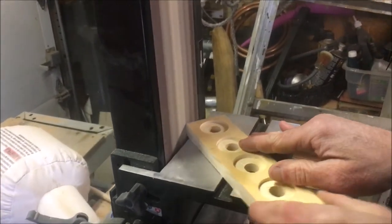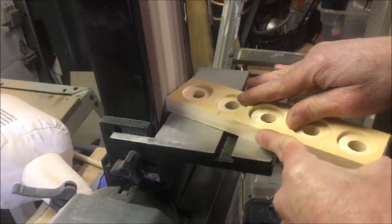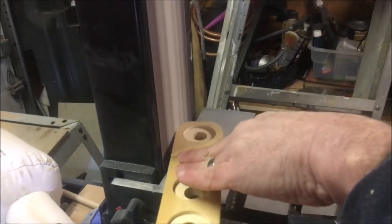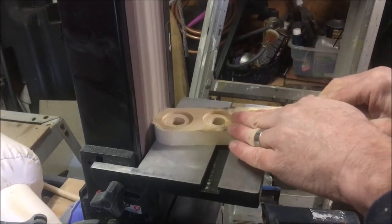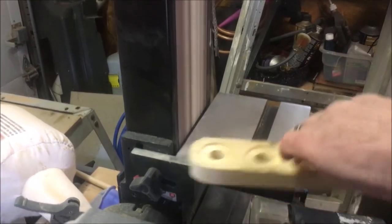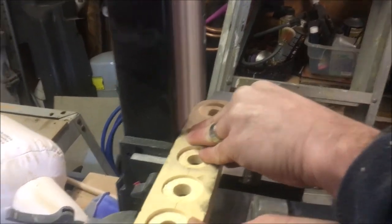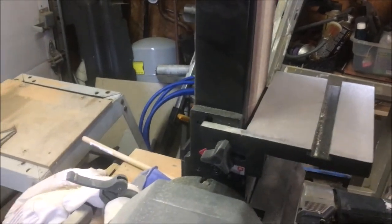I don't show this in the video here, but I stained it with a dark stain just so that the dirty hands — lead and powder and whatnot — wouldn't smudge up this nice white wood pretty quickly. So we just stained it a dark color and then polyurethaned it. I also added a little extra polyurethane inside the 9/16 holes that are drilled in there, because they are a little larger than the size of the ball and patch going in, and that helped hold it snug.